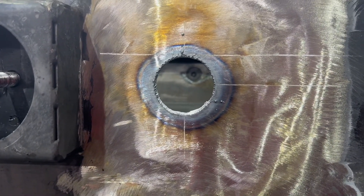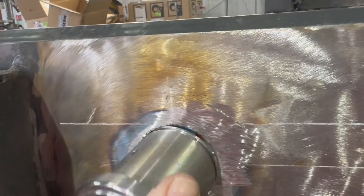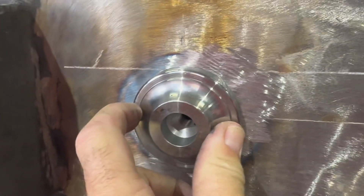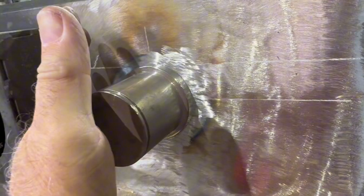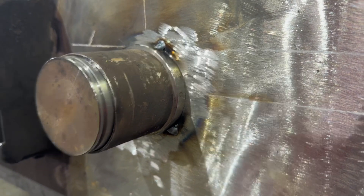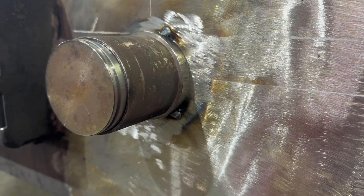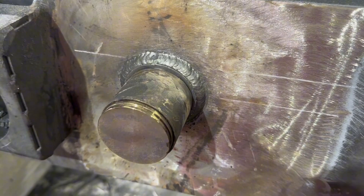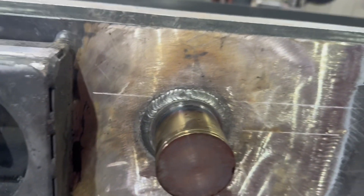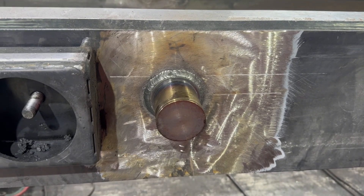There you go — the inside is all done, sorted, perfect. Let's get the hole cut out now and get the stub in. All this is flame-cut out; we just have to clean it up and get it welded in. That's about as good as we're going to get it, so we can get that welded up now. The stub is all ready to be welded on with low-hydrogen rods. We've put a protector on the stub to protect it and we're going to give it a bit of preheat. The stub has been welded on — we used two runs, a root and a cap, 2.5 low-H rods. The protector is on. Stub's all done, just needs a little bit of buffing, a bit of paint, and it'll look as if it's never been changed in its life. Thanks for watching.